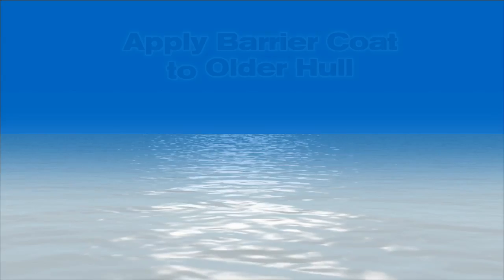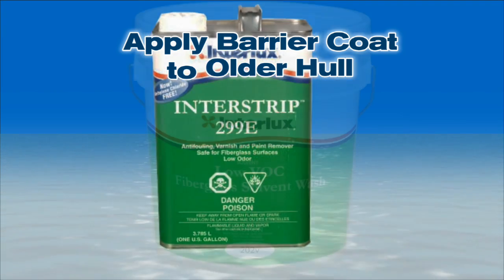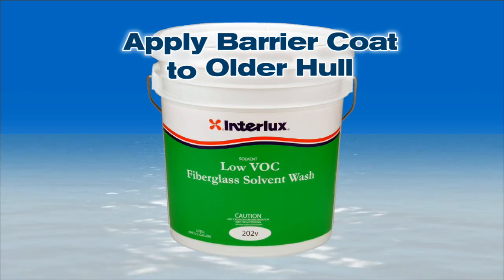If you have an older boat with existing bottom paint, the old paint must be sanded or stripped off. Interlux Interstrip 299E works great and makes the job much easier than traditional sanding. Once the old paint is removed, wash the bottom with a solvent wash and apply the barrier coat per the manufacturer's instructions. A few important things to remember before starting this project.